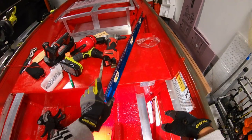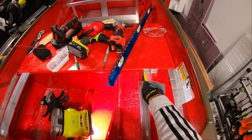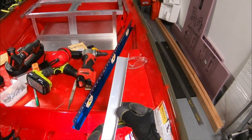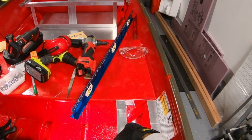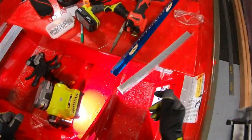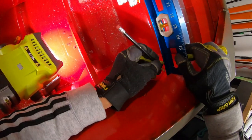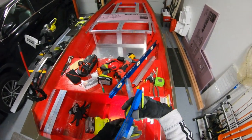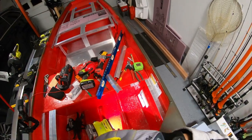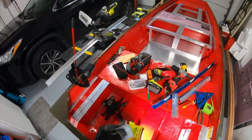One thing I want to point out: I left a 1/16-inch space between where I measured and where I put the bracket, because when I install the track going across, it's going to stick out 1/16 of an inch — the thickness of this aluminum. You always have to consider the actual aluminum thickness when doing your framing and measurements. I can't tell you how often you can frame everything up and it's tight because you're off an eighth of an inch. Once you know what you need to do, it's a lot of repeat, repeat, repeat — staying consistent, accurate, and focused. If you find yourself getting tired, stop and take a break, even pick up the next day before you make a mistake you'll regret.